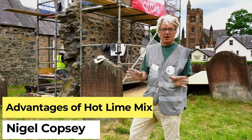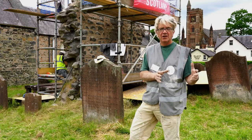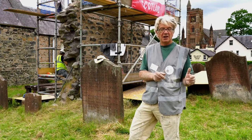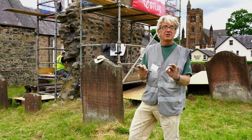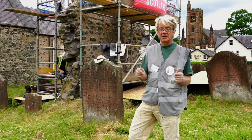Benefits from two primary directions. One is the workability and the water retentivity, which makes it useful for the mason. They can do good work with it easily, and it makes good bond because it is workable and water retentive, unlike materials that are not water retentive.